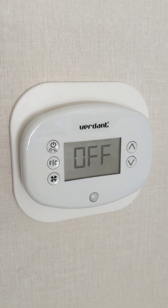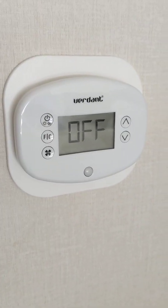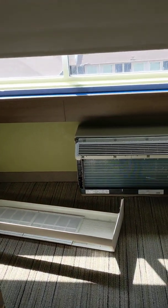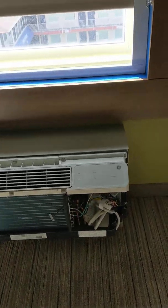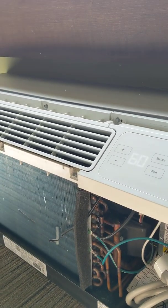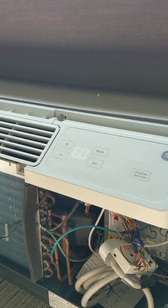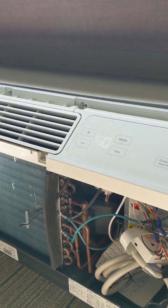So I wanted to do a second video on the GE Zone Line. If you luck out and happen to have this thermostat that you can't get into, and you have a GE PTAC over here — a Zone Line — there is a way that you can disconnect this thing, and usually it works. Don't get mad at me if you get yelled at by the hotel, but sometimes they can tell if you've been messing with things. There's an easy way to override this PTAC so you can control it all from the dash panel, and not from the wall thermostat. That Verdant thermostat on the wall won't even be an issue, because I'll just do everything on the panel.